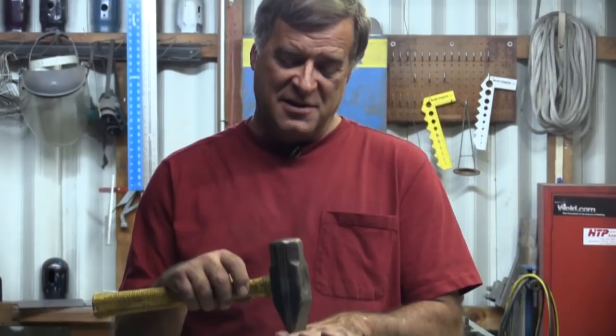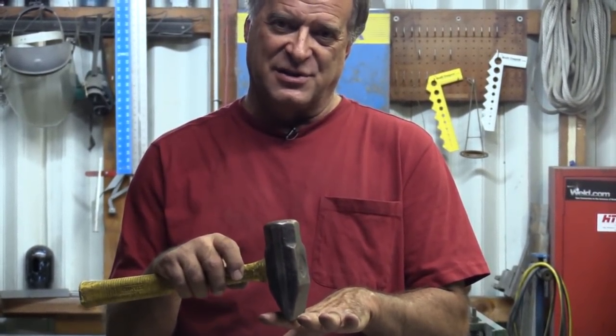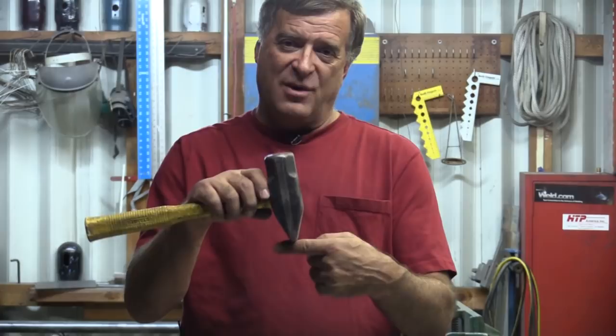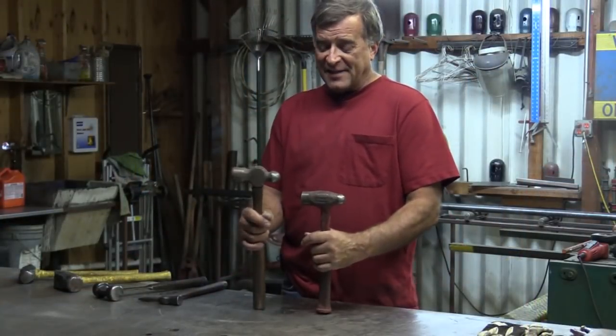Flattening and stretching. If you come down on a piece of metal with this end, you're going to make that metal go in two directions at once. If you come down this way with it, you're going to make the metal go in 360 degrees at once. So you can take a big heavy piece of stock and stretch that metal right out — roll it over, stretch it out some more. Whereas going the other way, you're just making a big pancake.